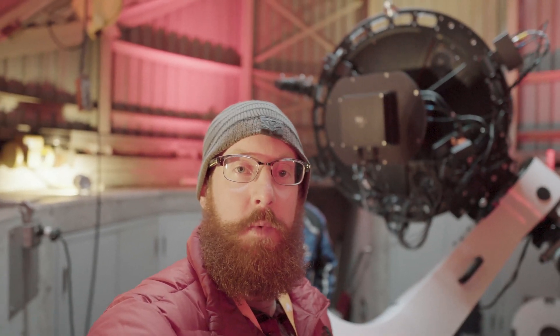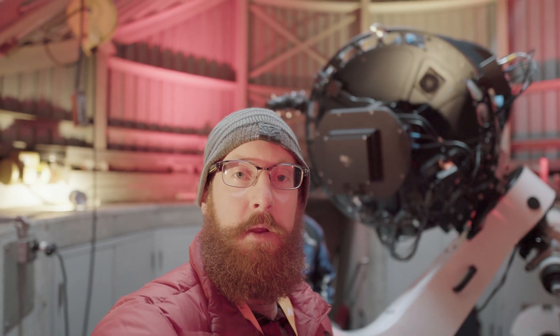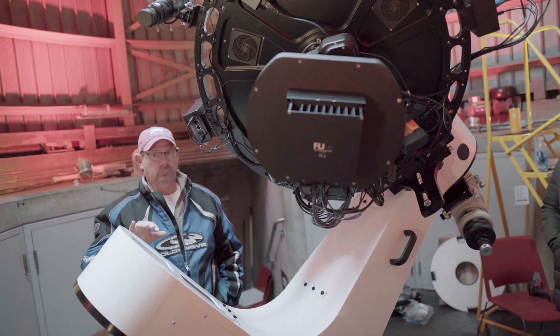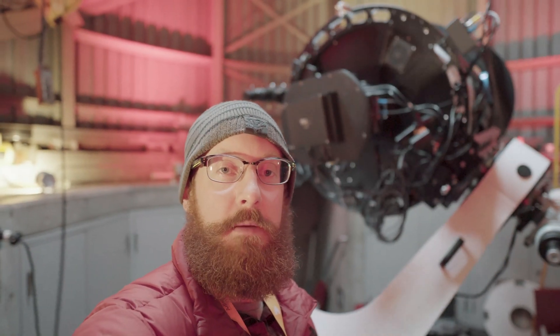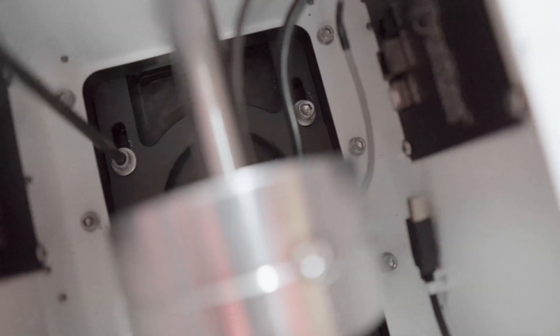Mark is going to show you that right now when he moves the right ascension axis, you can see that it doesn't stay in position, which means it's not dynamically balanced. From there, we need to move the lead screw on the right ascension until it does not move. Some positions will stay, but we need to fine-tune the balance — it's just going to be a minor amount of movement on the lead screw. We're going to balance the right ascension axis using a quarter-inch T-handle. There are eight bolts in the L600 base that allow it to slide — we just need to gently crack those bolts, then use the lead screw to balance the right ascension axis.